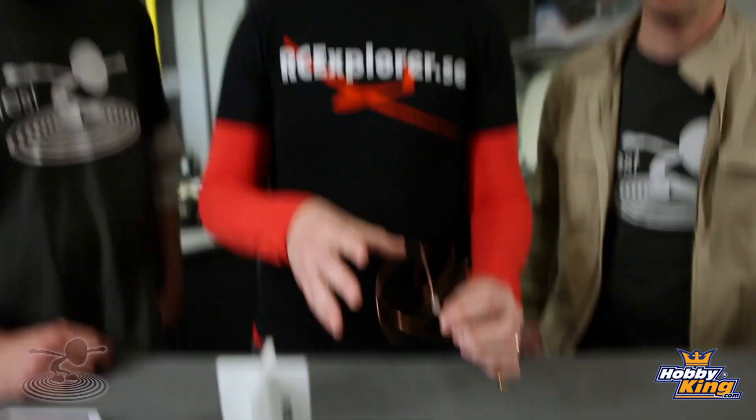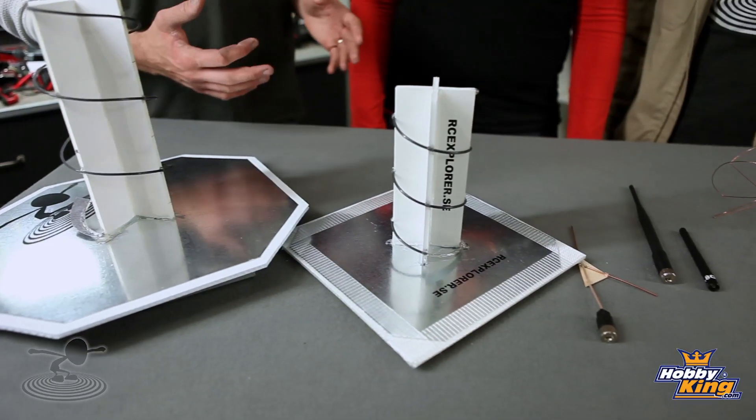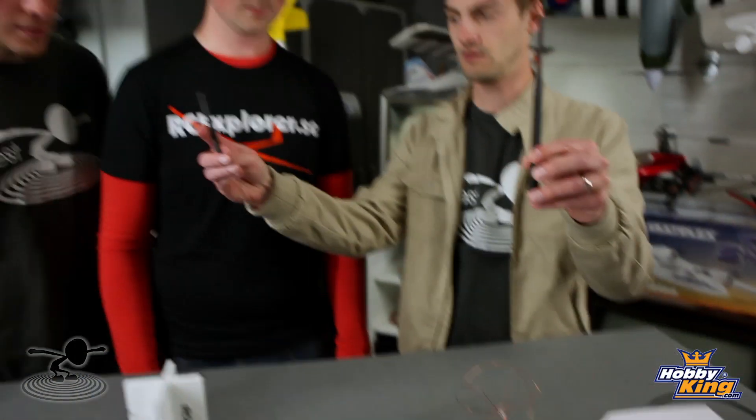This is homemade — you don't have to buy it. You can buy it now, but you can make it yourself. It's quite more cumbersome to make than a dipole antenna, but it's well worth the effort. Basically, building a tricopter FPV plane, circular polarized is the way to go — that's going to be your most solid, reliable link. To slow things down: with standard antennas, when you get a turn you get only a small area that connects. That's why you have this guy — the clover. It's a four-leaf clover; it sends out a corkscrew signal so that no matter which way you're turning, you're all good.